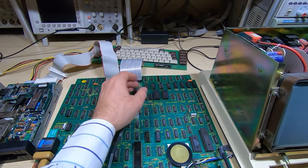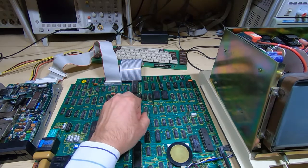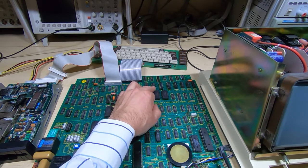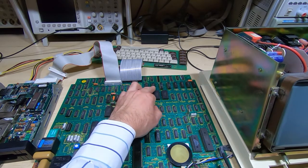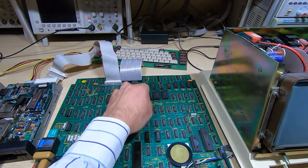Took the piggyback off and it stopped booting again. So in other words, it was a drive level from this particular device. I swapped various different manufacturing versions of the 244 out, and it would actually boot with a couple of the types. But even so, that's not the way it's supposed to work, so there's something wrong here somewhere.